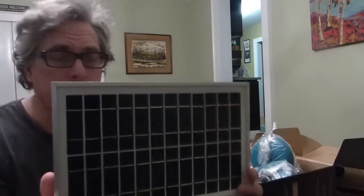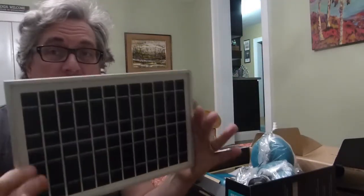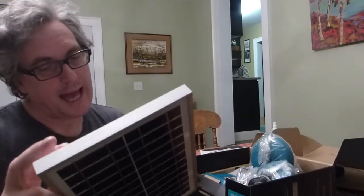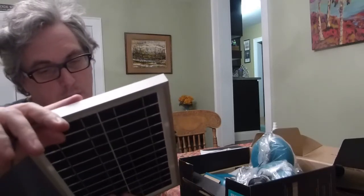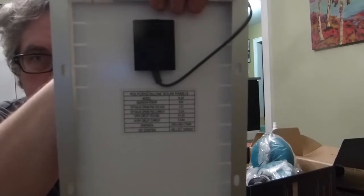All of this is powered by one solar panel, and this is a huge disappointment — not the size or the output, I wasn't that bothered — but the fact that it's a plug system and I can't sync additional panels. This is the panel. If this panel breaks, you have to get a new one; you can't add panels to the system, which is really sad. Maximum power is 6 watts, operating voltage is 12 volts, and operating current is 0.5 amps — so for those who understand this stuff, that's the specs.